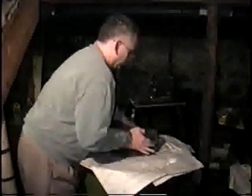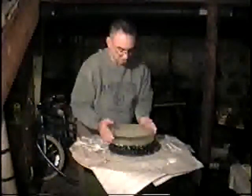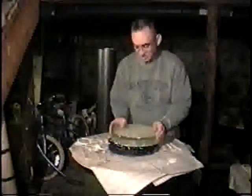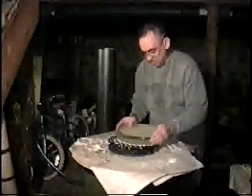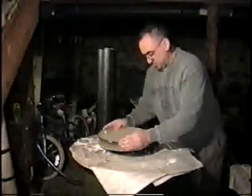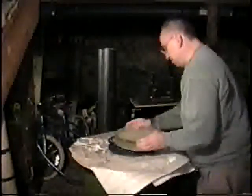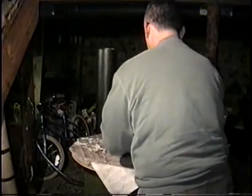put the mirror on the pitch lap. Got to be careful. Go back and forth. Different people have different methods of doing this. There's a lot of people that say use real soft pitch and real heavy strokes and really bear down on the pitch lap. I learned from a guy named Bob Goff, who's now deceased. He was an expert mirror maker, had made mirrors for Celestron, died in December 2001. And Bob taught me to be real gentle with the pressure, no more pressure than the glass itself. Just go back and forth and polish.